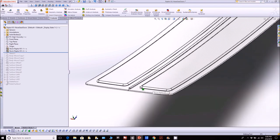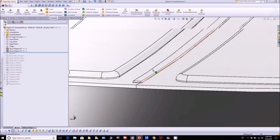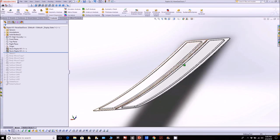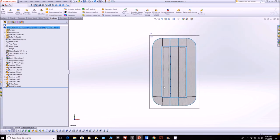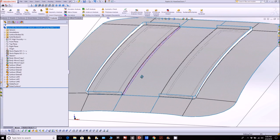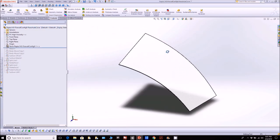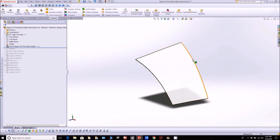Welcome back. Last time I forgot to mention what I was working on over the weekend: the nose gear doors. I was setting these up to create the platform for the molds. Pretty simple really — these show the core that's going to be in there to reinforce them. The platform ends up with two of them together with a little flange area in between, so we can do it on one plug instead of two separate ones. The other one I worked on was a hatch door for the parachute — if the parachutes ever deploy, this thing will just blow away.